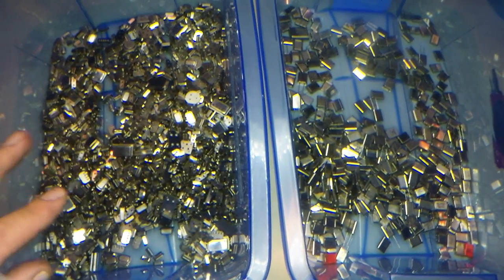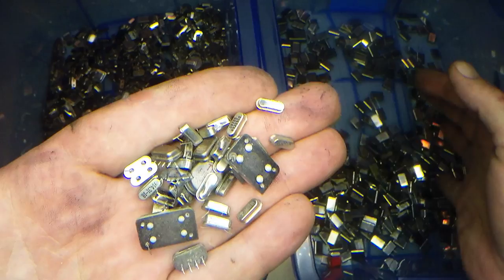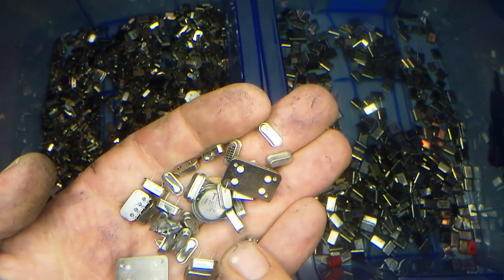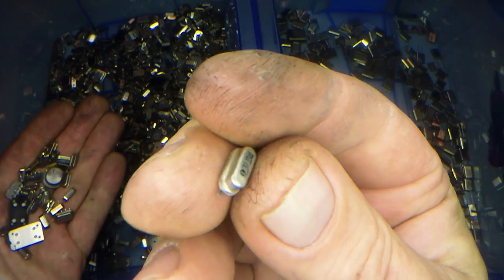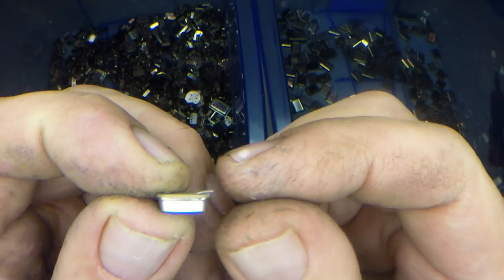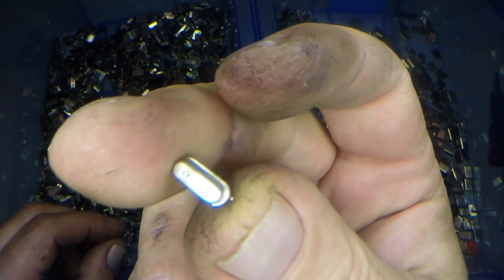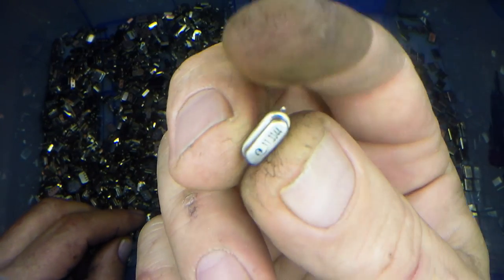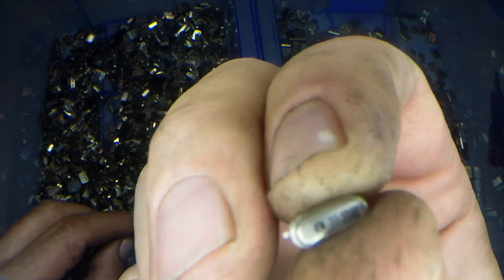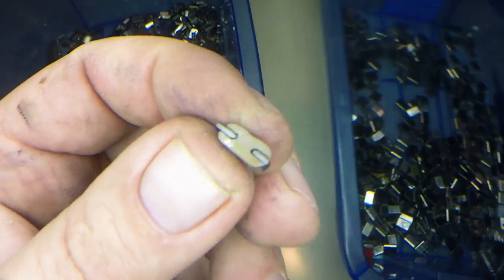What I wanted to show is the reason why I separate these long ones from everything else — crystals and crystal oscillators. Because these ones are really hard to get the silver out of. I'm thinking the only real economical way to do these very small crystals is to not try and open them up to get the little piece of silver out, because they usually crush and end up as little fine specks. Maybe process them another way — crush them in a ball mill, or find someone to melt the metal down completely and extract the silver. It's really complicated and hard.